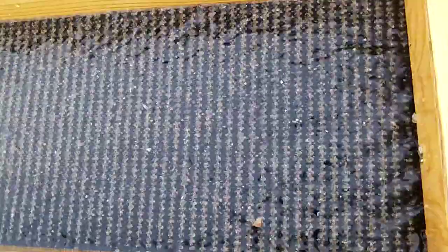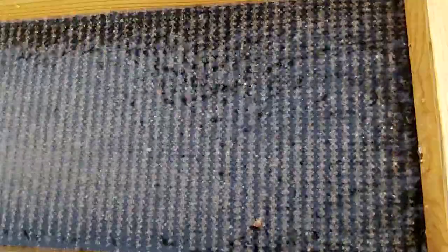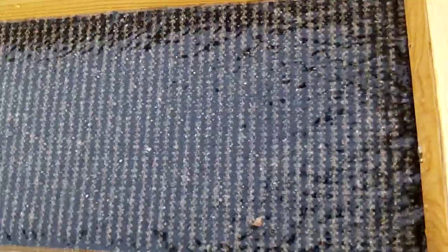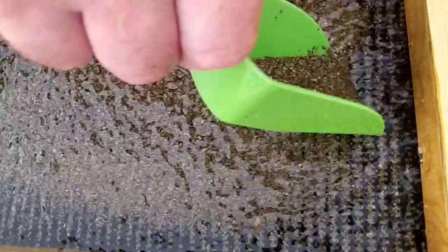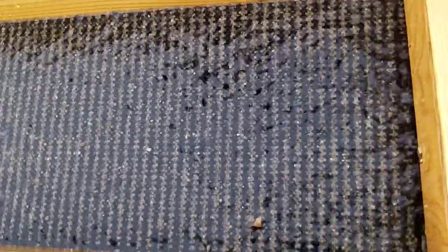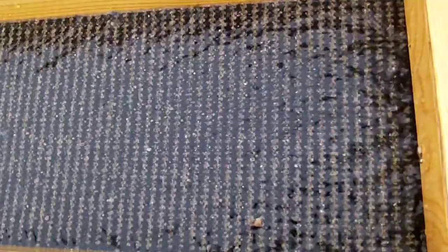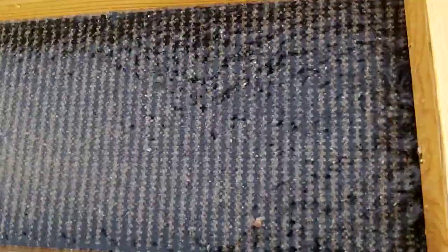Let's run another little batch and see how this works out. As you can see, the light material just moves off quite rapidly and the heavies all drop down into the mat. The little pockets will catch the heavier material like the gold and black sands. With that little dancing motion, the material is interchanging the way it should be — and you'll get this if your water flow and angle are set properly.